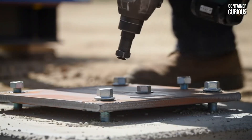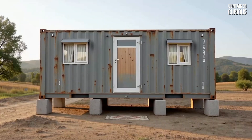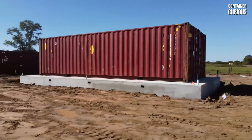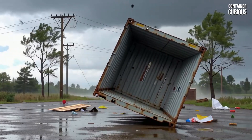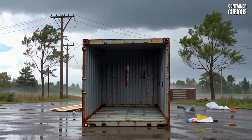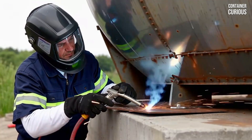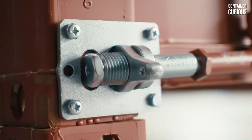The third and final rule is to turn your container from a temporary box into a permanent home. While a four-ton container feels immovable, it can still be vulnerable to shifting from minor ground movements or even extreme winds when it's empty. To create a truly permanent and safe structure, you must anchor it for a lifetime. This is done by physically locking the container to the foundation — the most common methods are to weld steel plates from the container's base to plates embedded in the concrete piers, or to use specialized twist locks that connect directly to the container's corner castings. This final step legally and physically transforms your project from a box sitting on concrete into a unified, rock-solid structure, ensuring it will never shift, slide, or move, no matter what nature throws at it.